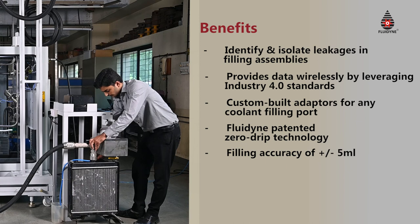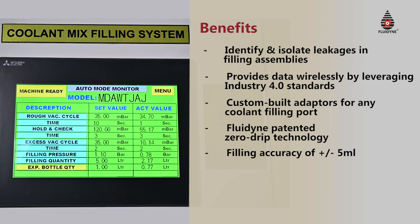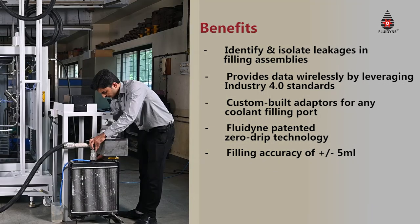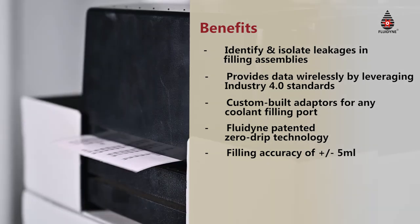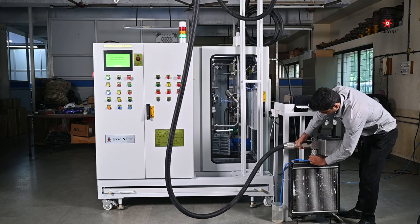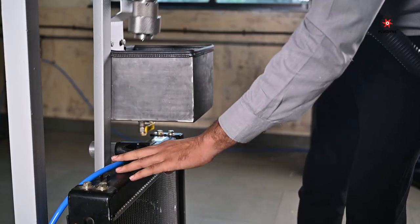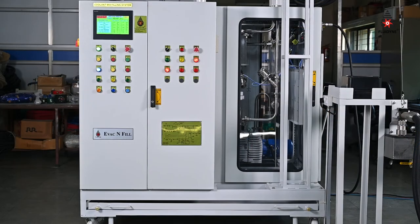In case of expansion bottles, we have a preset-based quantity addition of coolant. After the expansion bottle completes filling, the cycle is completed and a printed transaction can be obtained from the machine. With a simple quarter turn the nozzle is removed and parked in home position. There you have it — the 6780 coolant machine, which can be used with radiators and expansion bottles or degassing tanks. Check the link in the description box for connecting with sales to discuss your requirement.